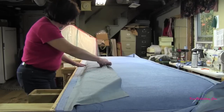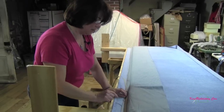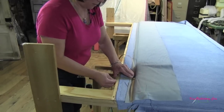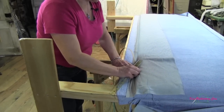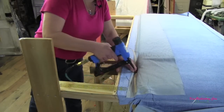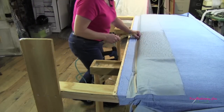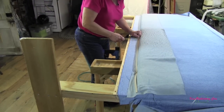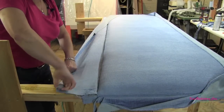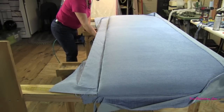This is where we're going to put another cardboard tack strip and flip this down. We've got our fabric laid down and I've got my cardboard tack strip. I know that I need that to be four inches up from the bottom, so we'll get it into position and push the cardboard strip up there. We'll do this in a few places to get started and then go back and fill it all in. Now pull it down and take a peek — looking good. Now we'll pull it underneath and staple it.